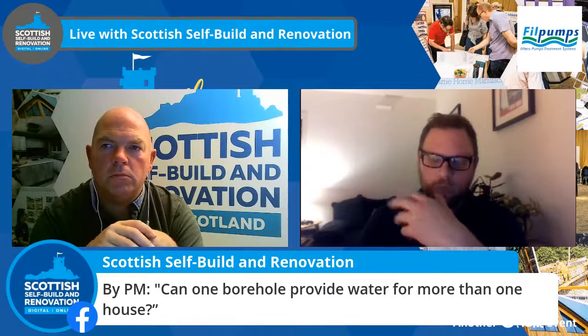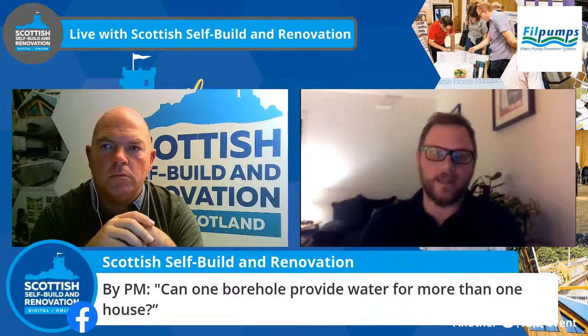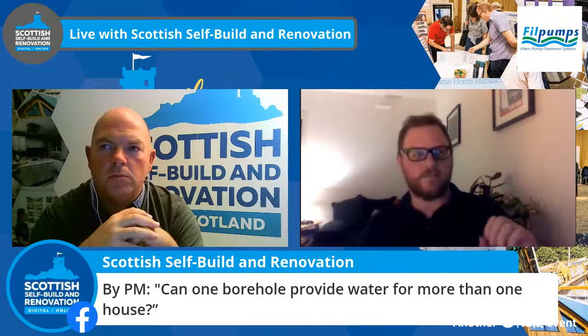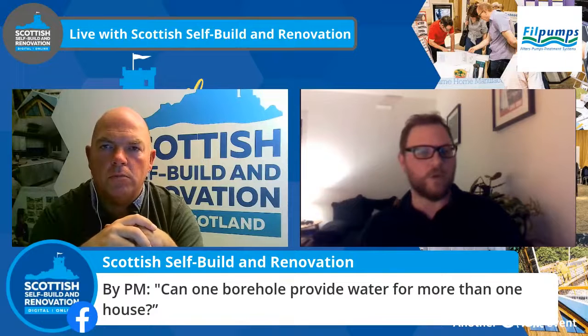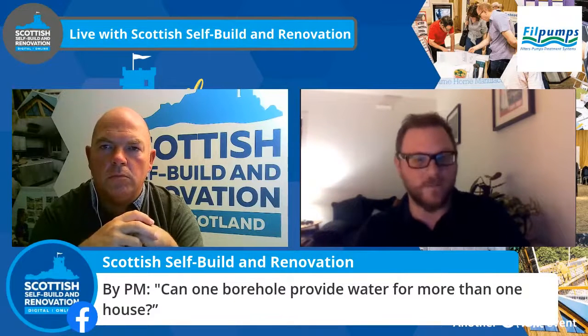So when it comes to piping, it is very important that, again, we're consulted at the beginning, because it could be that, depending on the distance from the water source to the house, to overcome pressure losses, you might need 32 or 50 mil pipe, but it might be the smaller pipe is laid just because perhaps that's what the civils contractors or the plumbers are familiar with.